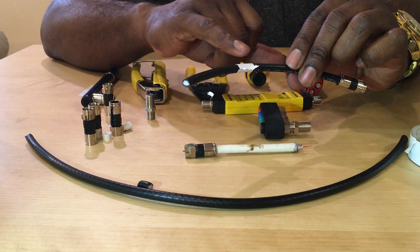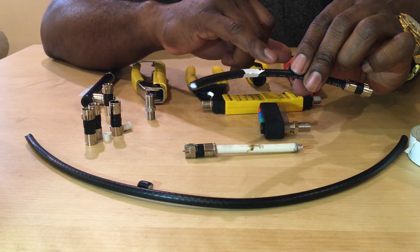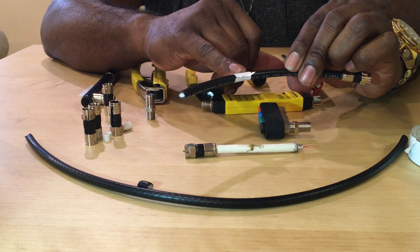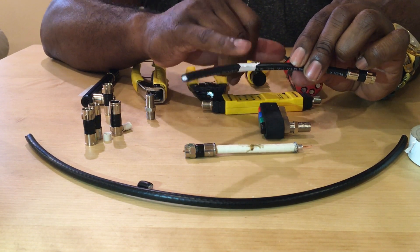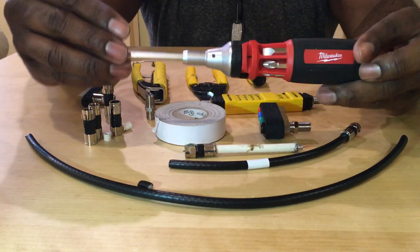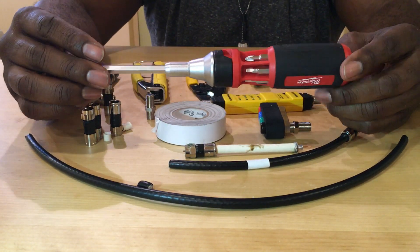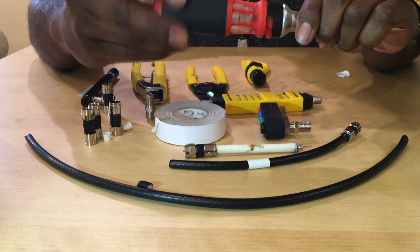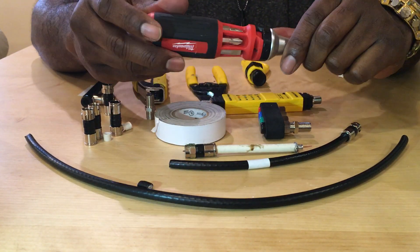My guy was working on this wire — here's our white tape, it's just a marker. You don't have to write anything on it, just get some color tape. We prefer white because it's black cable outside. This is beneficial because you're going to start undoing drops and you're going to have 10 or 20 — when you find your drop, make sure you just locate it with a piece of light tape.